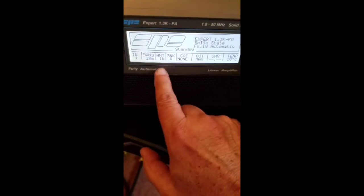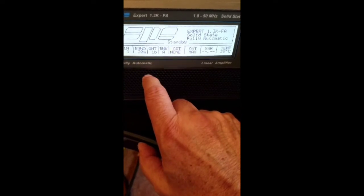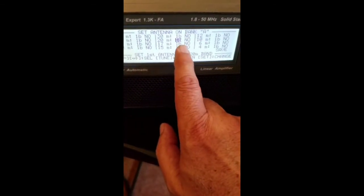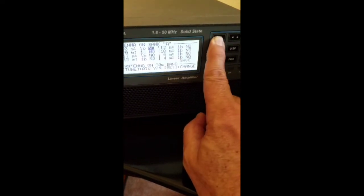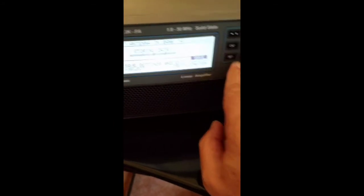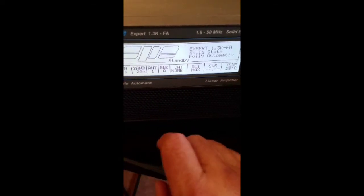The antenna is on 20 meters and it's indicating 1B — that means the output is antenna 1, the input is antenna 1, it's the 20-meter band, and it automatically knew that based on when I just tuned it up. The next thing we have to do is remove the B for bypass. We hit the set button twice and that puts us in the antenna mode, and interestingly it goes right to the 20-meter band. We hit tune again while it's in the set mode, which disables the B — meaning it's no longer in bypass mode. We scroll through to save and hit set, storing that information. So now the input antenna is on connector 1, the output antenna is on connector 1, and there's no bypass.